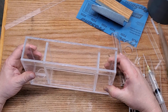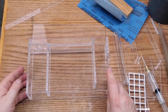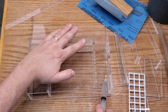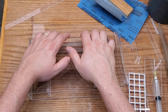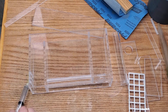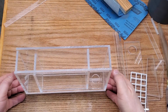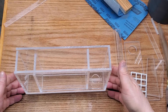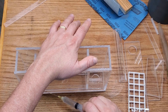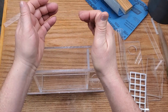Because I was concerned about how narrow this was, I cut the bottom about 30 thousandths of an inch wider than the actual dimensions needed. The reason is that it's never going to be seen, and secondly I don't have to attempt to reach my hand down through all of that — I can just go around the outside. It's actually a really good way to do it, and if something needs to look more finished you can always just trim off the excess acrylic afterwards.